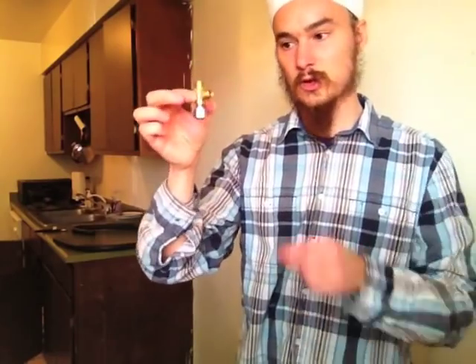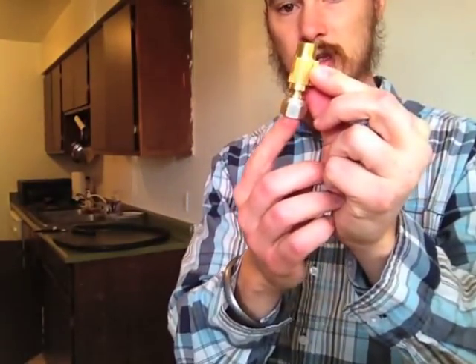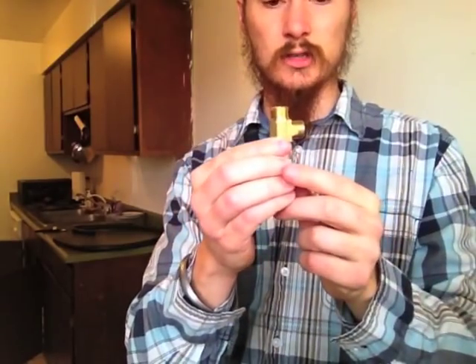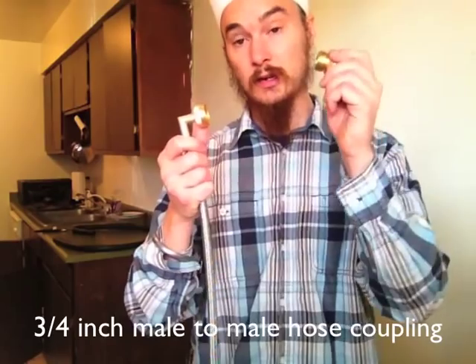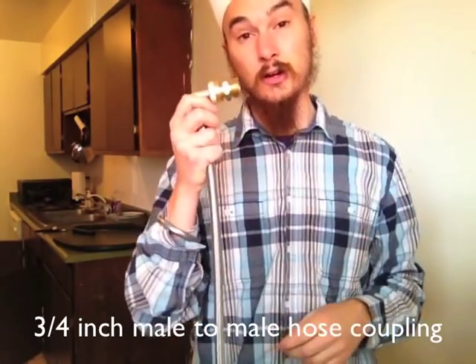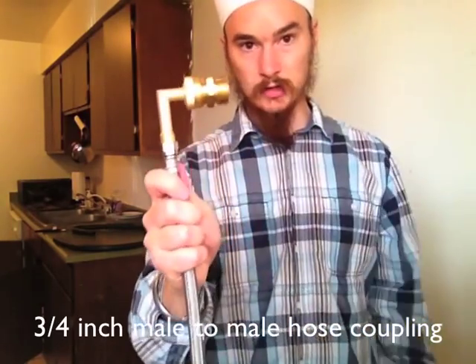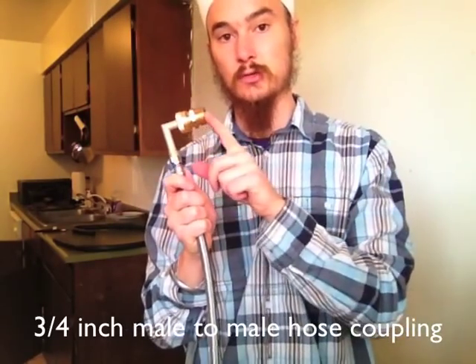You'll get under your sink, turn off the water, and remove the hose going into your faucet. You're going to put in one of these adaptive valves so it'll have an inlet, and then it branches off — one to your sink, one to your washing machine. If the washing machine hose isn't long enough, you can get another male-to-male garden hose threading, it's also 3/4 inch, and that will connect right on there so you'll be able to attach your normal washing machine hose to this.